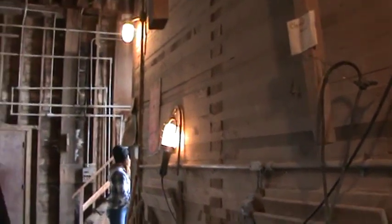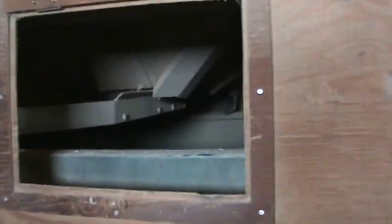This is the back pit. When you take the grain out of these bins, it dumps into this back pit and gets elevated up again and comes around. There's a scale right here — about a 100-bushel hopper. It dumps into the back pit, gets elevated out, and dumps into the rail cars. That spout out back was used for loading the rail cars, but now we've changed it to load trucks instead.